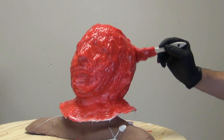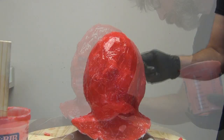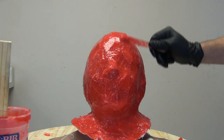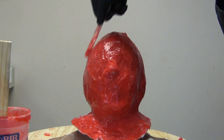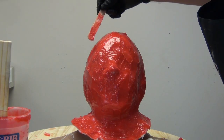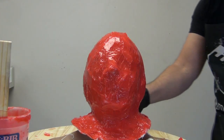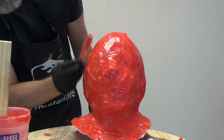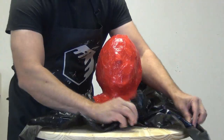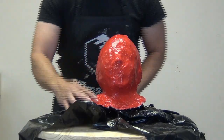This is my second and final layer. Typically for a production mold I'd do at least three or four layers with a runny print coat for surface detail, but for this it wasn't necessary. On the second coat I made it even thicker, using that full one percent of the thixotropic additive. Then I came back with a tongue depressor and stir stick to smooth out the outside — you want it as smooth as possible so the shell doesn't grab rough peaks on the silicone, which could also cause misalignment and distortions in your resin cast later.